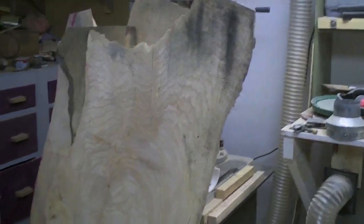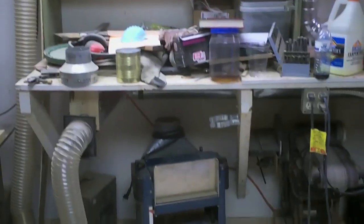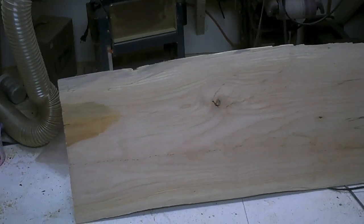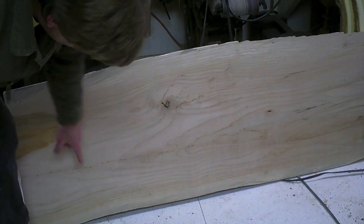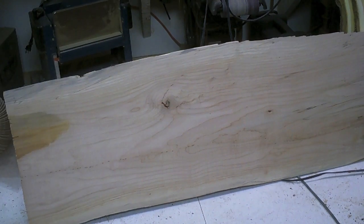Here are some examples of the big slabs — in this case maple crotch, up from a big crotch. There are three real big heavy slabs there, and since I had access to that big sander I went ahead and sanded two of them. That one's a really pretty one, and because of the distress the tree was under you can see a dark line right here — about that wide — where you've got fiddleback figuring on either side.